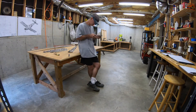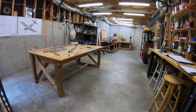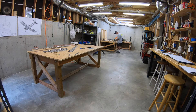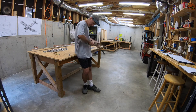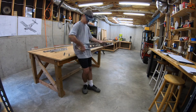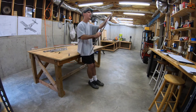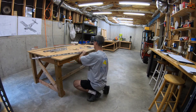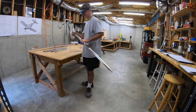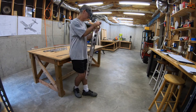Deburring is by far the most time-consuming part. I'm trying out a few different tools — I'm using a magnifier to really see how thorough I can be. I use files, a couple of different blades that fit in a little deburring tool on the table, the different 3M wheels on the grinder, and also a smaller wheel chucked in the drill press. There I'm using the little edge deburring tool, actually just holding it in my fingers to try it out.